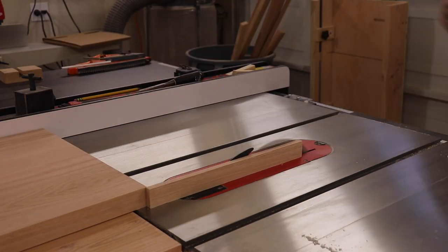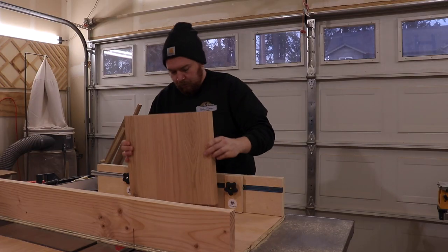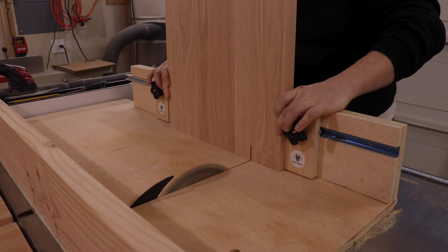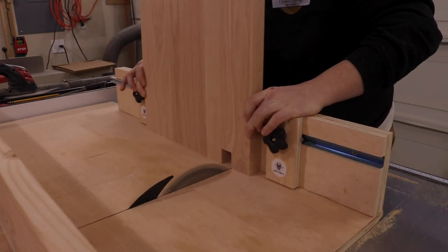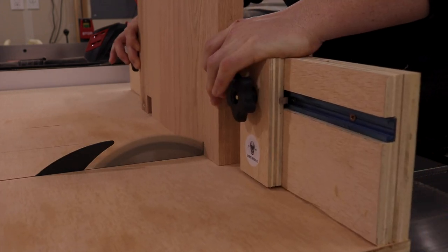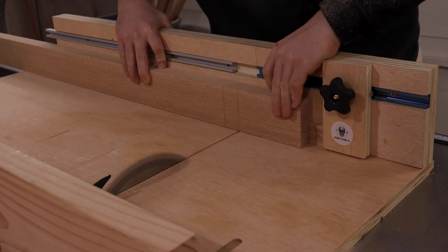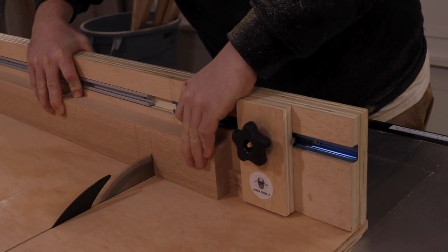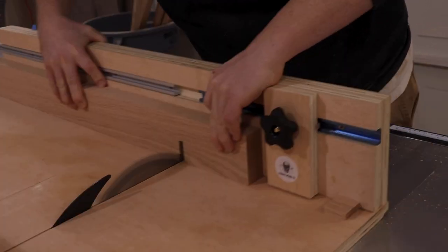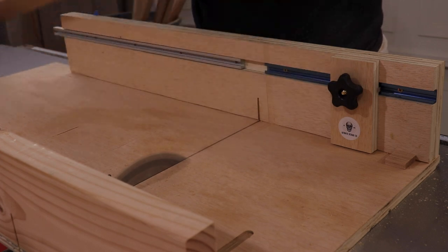Now I'm cutting a three-inch piece for the stretchers, which are going to have a half-lap in them. I'm using a crosscut sled I made specifically for this build along with a flat-tooth grind blade for more control compared to using a dado stack — it's some extra work but the results spoke for themselves. One lesson I learned: I initially made a stop to the thickness of the dado, but that didn't account for the thickness of the blade. You need to make the stop the thickness of the dado plus the width of the blade, and if you do that you get a perfect dado every time to match your leg pieces.